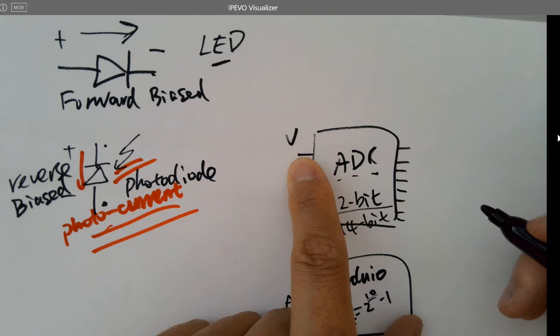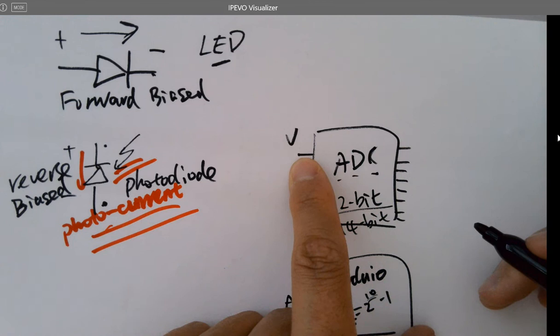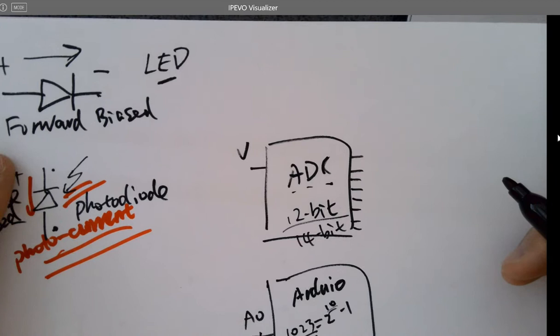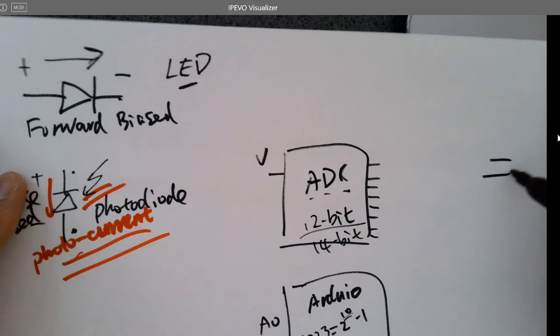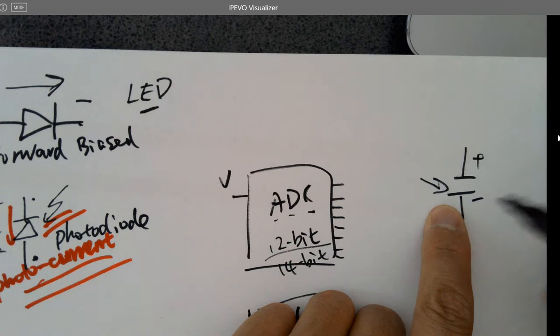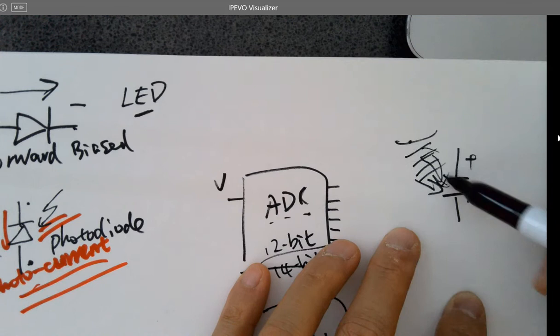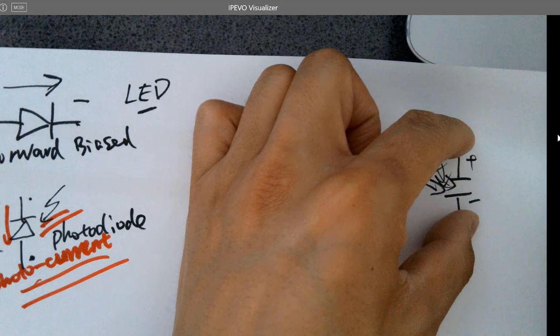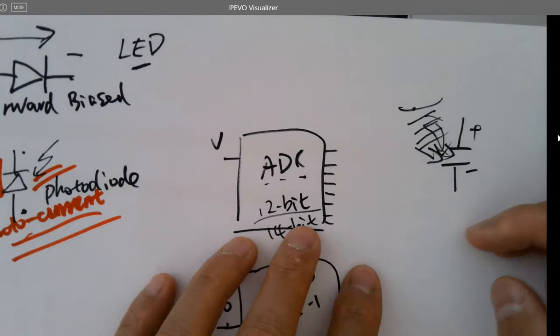So the ultrasonic sensor for distance sensing. Yeah, an ultrasonic sensor is a transducer, right? And what's the transducer doing? The piezoelectric material. Whenever there's pressure applied to that little device, it's going to show a little voltage difference. If this is a piezoelectric material, you hit it, boom, voltage. You give pressure, voltage. You have an ultrasonic or sound signal, hit it, voltage. The ultrasound device in the hospital that radiology uses, the little probe, is the same thing. It's an ultrasonic transducer. Whatever sound is received, boom, voltage. All right?